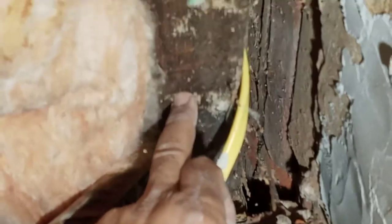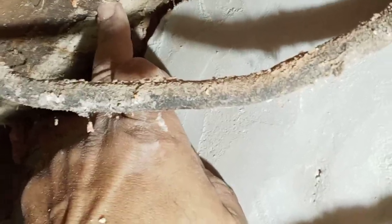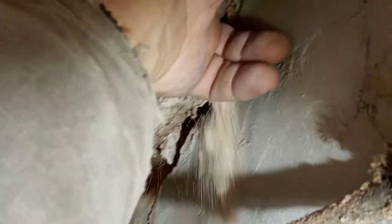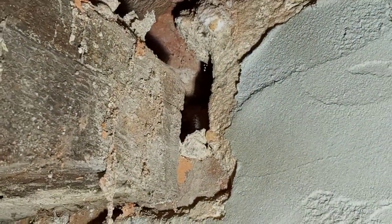The support now is just whatever deflection resistance remains. It looks like it was pocketed in at one point and they even notched — scarfed it — and pocketed it in. I can see a pocket here. You can see where the wall rotated and the load creep over time lowered this beam.